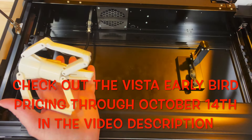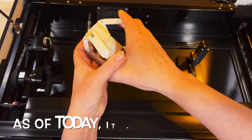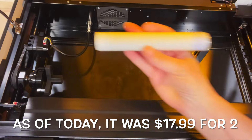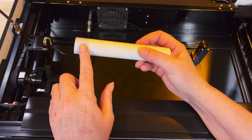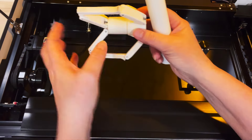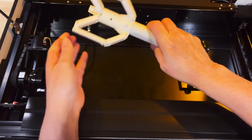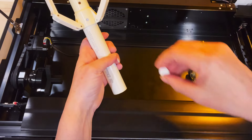Here's the extender that I bought to use on the WeCreate lasers. It came in a 2-pack, and it was about $15. To use it, I cut some 3-quarter inch PVC pipe, and I cut it at 6 and 1/4 inches long. Now, these extenders came with a type of tape that you put around the PVC pipe, but when I used that tape, I couldn't actually get the PVC pipe down into the extender. So I ended up just using some heat-resistant tape, because it's what I had on hand.